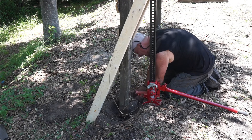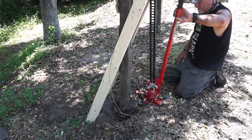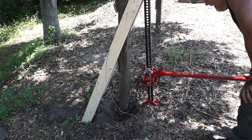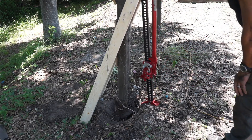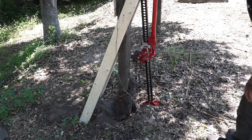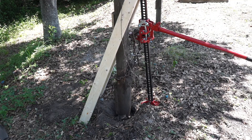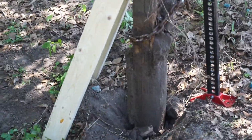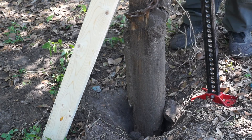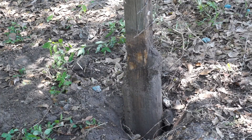This is my preferred method of removing fence posts. I'm going to take about a 36 to 48 inch length of chain with two hooks on each end, wrap it around the bottom of the post, and then wrap it around a 36 to 48 inch farm jack and literally jack the post directly out of the ground. I've got a separate video that I'll leave a link to here that goes into more detail on removing posts with a farm jack, including posts that are rotted and how to still get the bottom of the post out of the ground without having to dig it out.